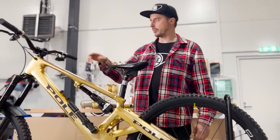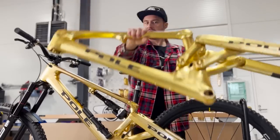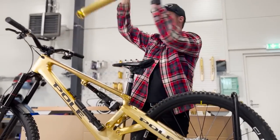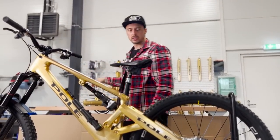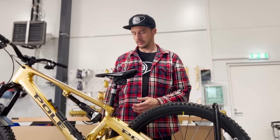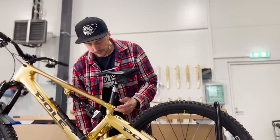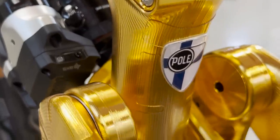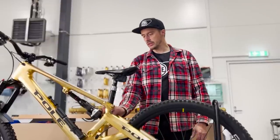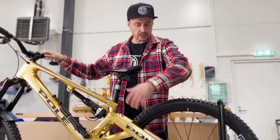On the other side of the bike, the seat tube area is updated from even Voima. The previous model was positioned a little lower; we moved it higher so it doesn't hit the tapered part of some seatposts, and also for a cleaner look. We also reduced weight from the seat post and seat tube area — with this design we could cut away some material, so the seat tube wall thickness is actually quite thin now.